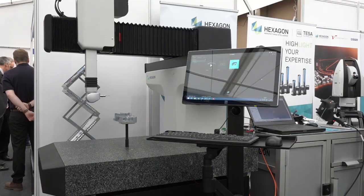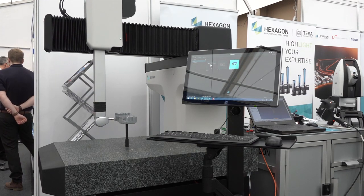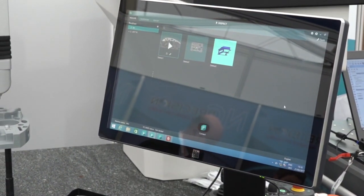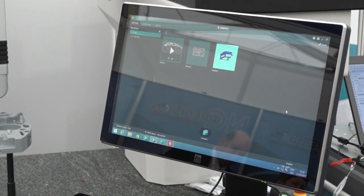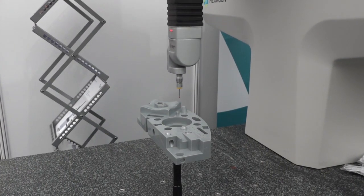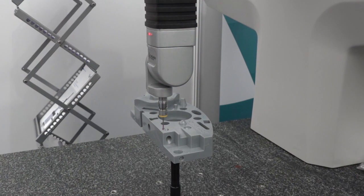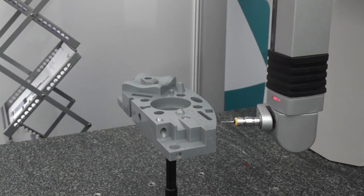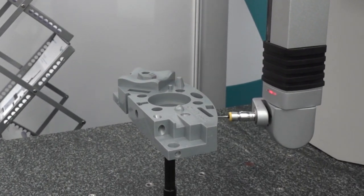Would this be aimed at subcontracting companies rather than OEMs? I would say both, to be honest. It's very good for small subcontracting job shops — you put a part on it, it has a nice user interface, very easy to program, quite intuitive, easy to use. Even I can run a program on it, it's that easy. It's ideal for first-time users and small businesses, but also for larger OEM businesses where they want it on the shop floor next to the machine tool. It can measure anything our bigger machines can measure within its volume.